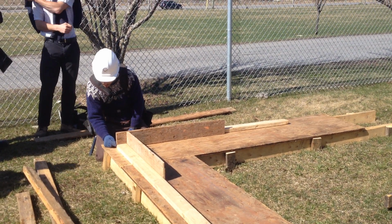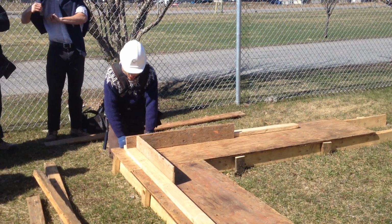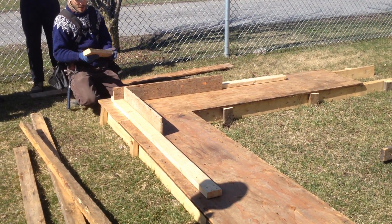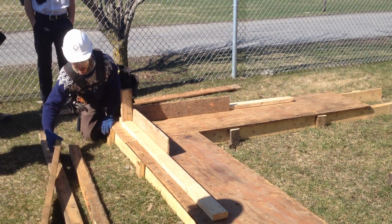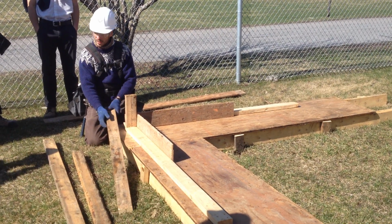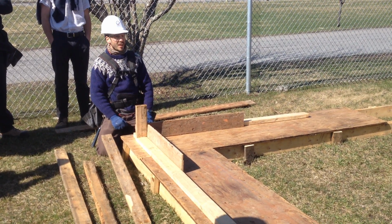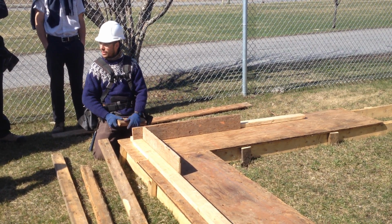I know that I want to be back from this over here a 1/4 inch. Why did we do this 1/4 inch? Well, it became very relevant when we started to do our whalers. Because I'm gonna have a stud over here, my corner stud, right? You see this? And then I'm gonna have a whaler that's gonna go there. So if this plywood sticks out, my whaler is gonna be bumping onto the plywood, and when I put in my wedge, my whole form will wedge apart. All right? So this is why we set back a 1/4 inch over here.